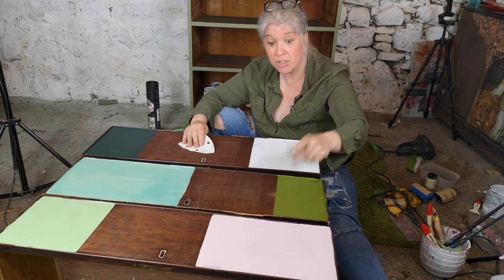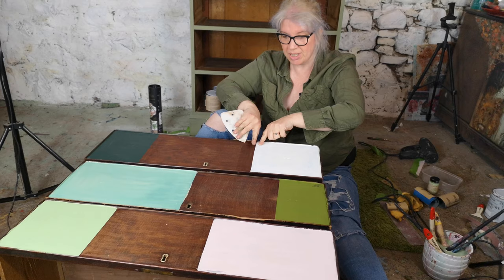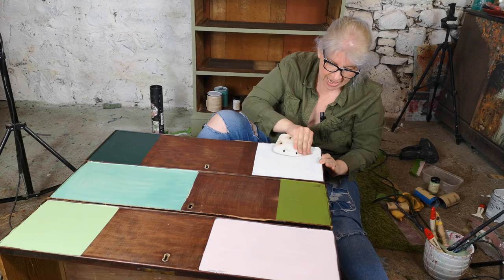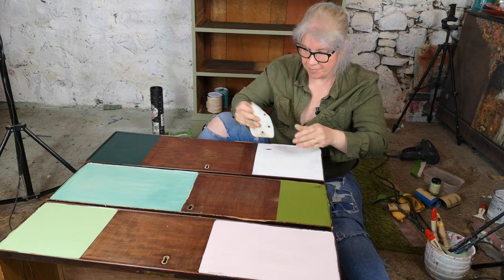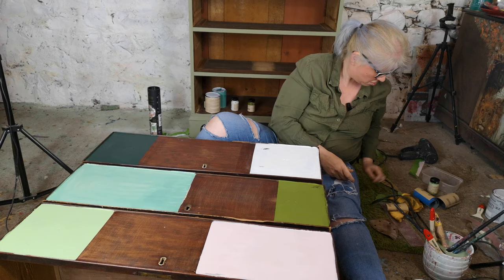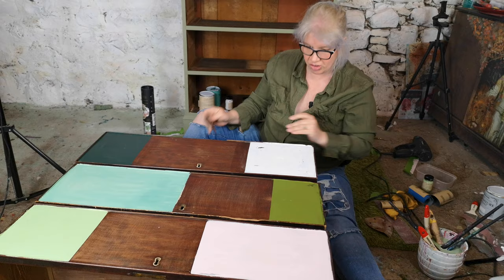So what I'm going to do now is use a reasonably heavy grit, 160. There's going to be a piece of wood that comes down here, so you're not going to see any of the distressing I do to this edge. I just want to give it a little bit of distress here and there. If you feel that's not going to be enough, you can get a more meaty grit, which I've got here. So just a little bit, you don't need to go crazy, just a bit of a distress, something like this.